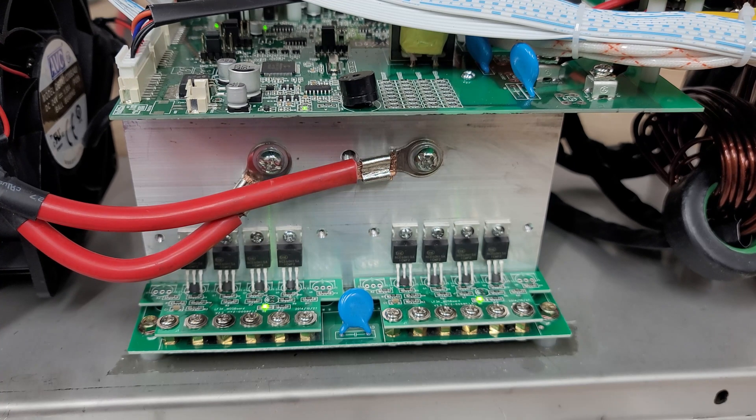Working perfectly. Hopefully that answers some questions about the green LEDs — they don't necessarily indicate the health of the mosfet boards. They could look perfectly fine with no LEDs and actually function. Another thing: the LED driver resistor might actually be burnt out, so LEDs can fail independently. I have had brand new mosfets out of the box with a non-working LED, and the mosfet boards worked perfectly fine. So don't always take this at face value — make sure you test them yourself.